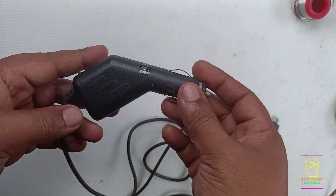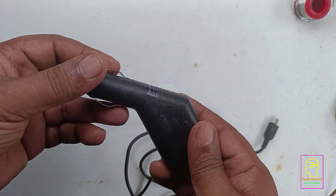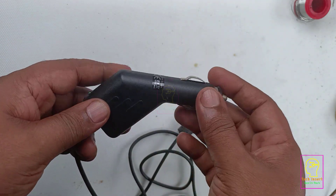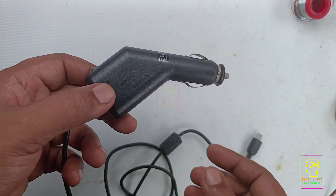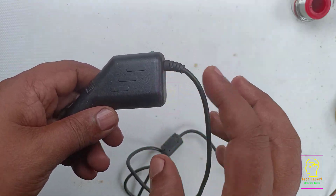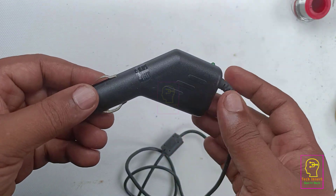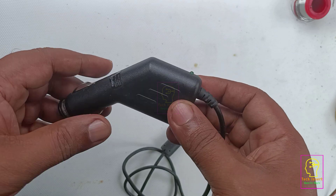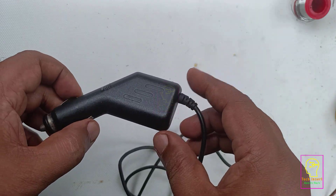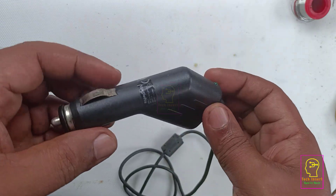So I thought of converting this to a fast charging mobile charger. Currently I am using a slow charging mobile charger — that means it is 5-volt and can deliver 2.1 ampere maximum. Our fast charging module will support QC3, QC2, and many other protocols, so you can even charge your iPhone using this charger. Fast charging means your mobile and your charging cable should both support the fast charging protocol, else it will work as a slow charger. We are going to make this using a charging module that supports all these protocols.